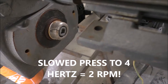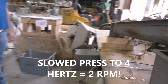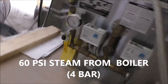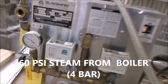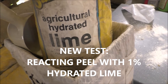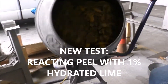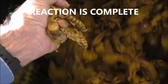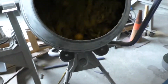That is 2 RPM. Feeder screws at 60 Hertz. Pressure in the boiler is at a little over 40 PSI. We've added hydrated lime to the peel. And if I grab some of this peel, you'll see I can squeeze a stream of liquid out of it — so it's been reacted with hydrated lime.